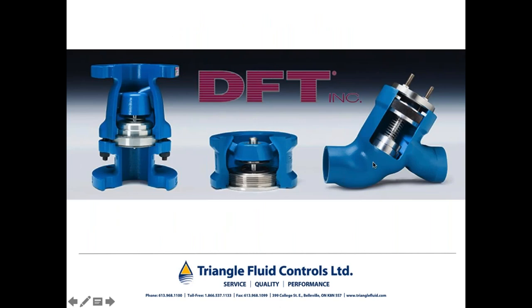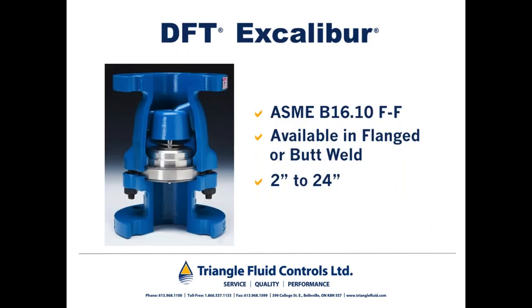So let's talk a little bit now about some, or all, of the DFT check valves that are available. Here we have the DFT Excalibur, ladies and gentlemen. This is a raised face flange connection, split bolted body design that is ASME B16.10 face-to-face. So again, that's the standard face-to-face dimension for most flanged valves.